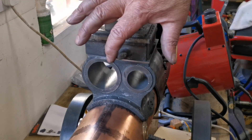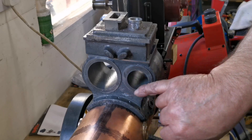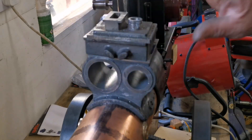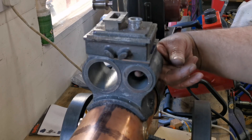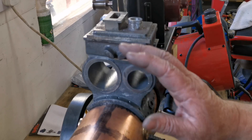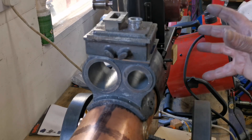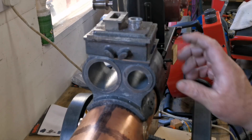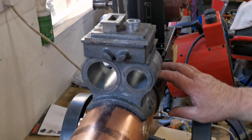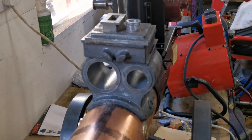I'll leave all this part for later. The next thing I've got to do is sort out the cylinder covers, both ends, because I've got to drill and tap some holes around there to fix them. When I've done that I've got to hone the cylinders. Then I'll be able to make some blind bushes, take all this apart, drill and silver solder the blind bushes into the boiler, put all that back together, bed that on some steam sealer, and then all of this will be in one with the smoke box onto the front. So it's good — slowly coming on. It's a very long job.